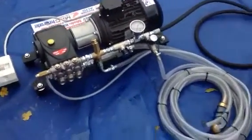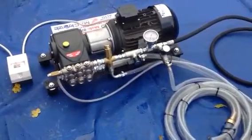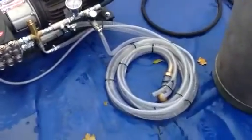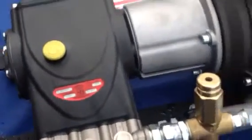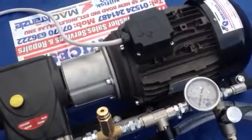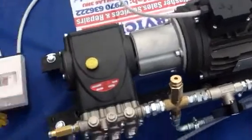This is for testing and pressure testing vessels and so on at high pressure, also fairly high volume as well — all different specs available. This is on a male-male system so we can't get shaft wear and tear by running male motor, male pump with flange in between coupling.